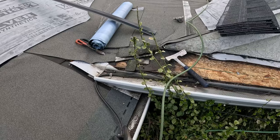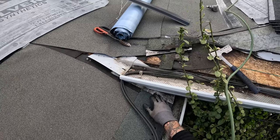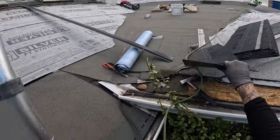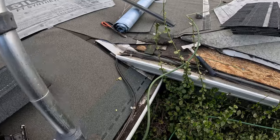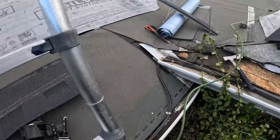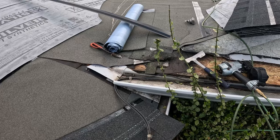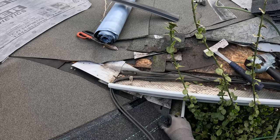These are the first two pieces — metal first, this under this. Nailing these and getting in here isn't as important as you think; these are nailed to the fascia and screwed with the trough, they're not going anywhere. I won't worry about tarring or covering these holes because these shingles are going to seal in here once they heat up. I'm not going to put any more holes in it because there's no point doing things twice for no reason. You can see from ripping it out how tight everything was in here.